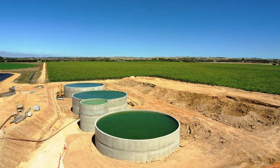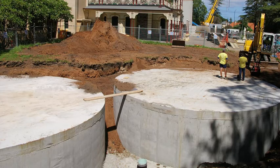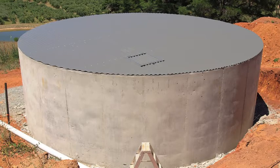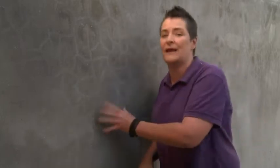Now finally, I want to mention concrete tanks. These are bigger tanks, generally used by factories or farms, especially those in bushfire-prone areas. Concrete tanks can be installed either underground or above ground. They're fireproof, rustproof and keep the water cool, clean and algae-free. Now one of the drawbacks with concrete is that it's porous, so if tree roots penetrate the structure, it can crack and things can go pear-shaped really quickly.